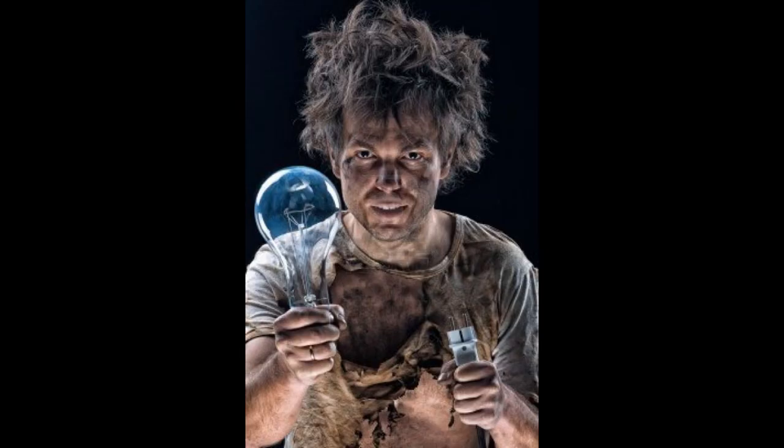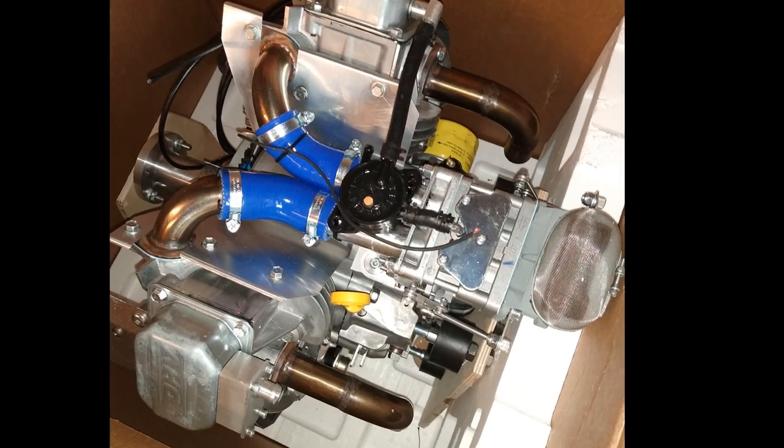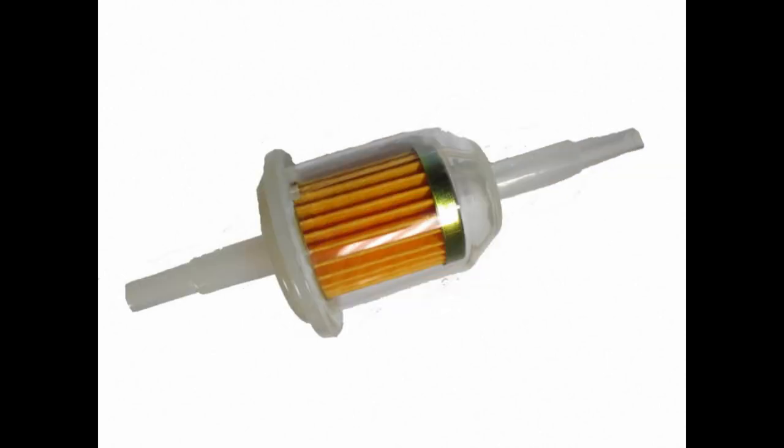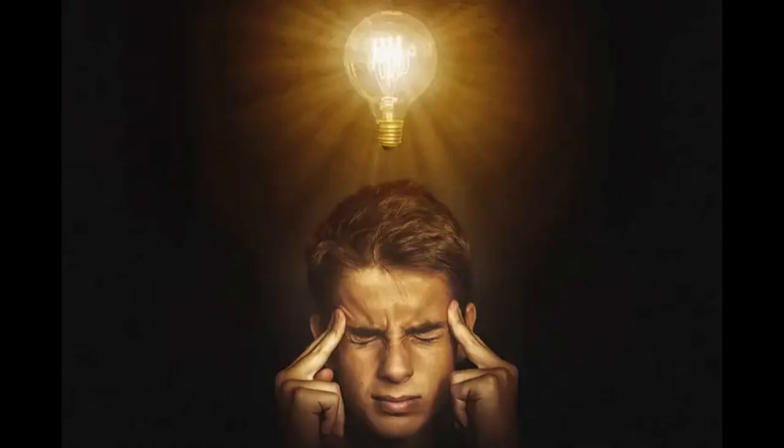As you might imagine, things are now getting a bit confusing. Did I have a fuel problem? An electrical snag? Something wrong with the carburetor? I swapped the carb for a new one on a new engine. No changes. I changed the fuel filter back to the old one. No improvement. I changed the plugs again. Nothing changed. Then I had what they call a light bulb moment. This now seems obvious with hindsight, but with one cylinder apparently dead, I changed the plug leads over. The dead cylinder was now on the other side.